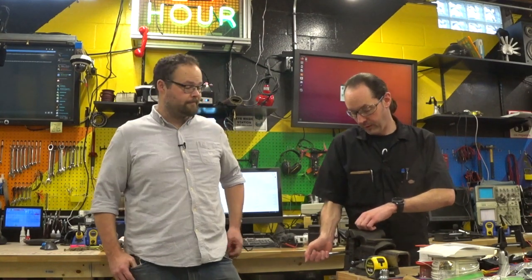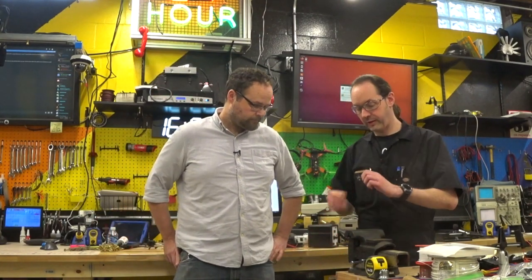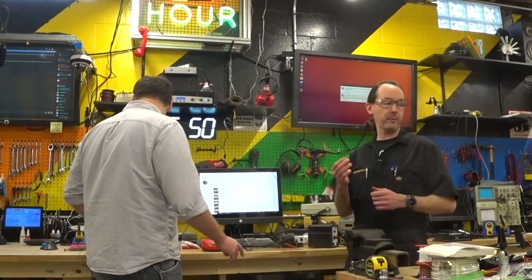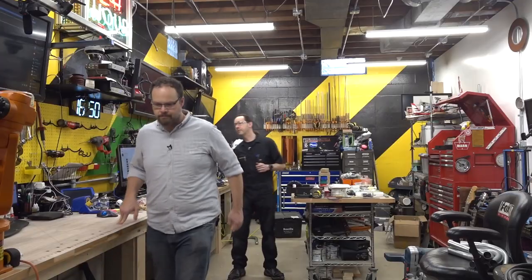All right, so we're drilled, we're tapped, we're good. We're at exactly 90 degrees. And now we take this out and we have to put grub screws in it. We have to wipe it off. Where's your shop towels? I have paper towels. I always have paper towels.